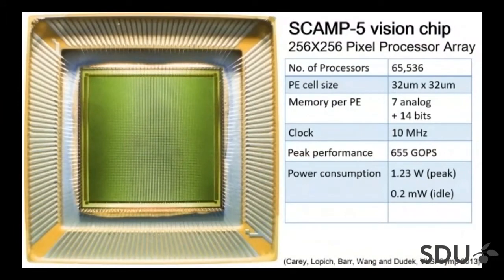The examples in this talk are all recorded with the SCAMP5 vision chip. It's an array of 256 by 256 processors, so in terms of pixel resolution it's not very high, but there are 65,000 processor cores on this chip. We're trading off resolution for frame rate. The clock of a single processor is pretty low, but because of the very large number of processors the overall performance is quite high — about 600 gigaops at about a watt. This design is in a very old silicon technology, 20 years old, so there is 20 years of Moore's law still to exploit to make it faster and more power efficient.